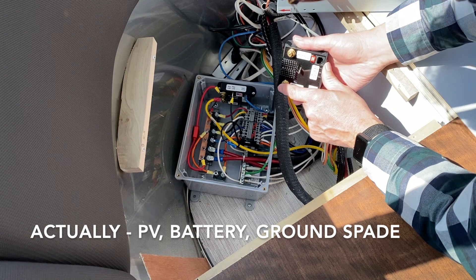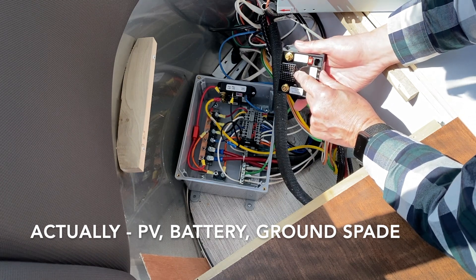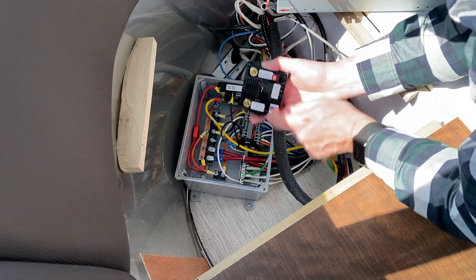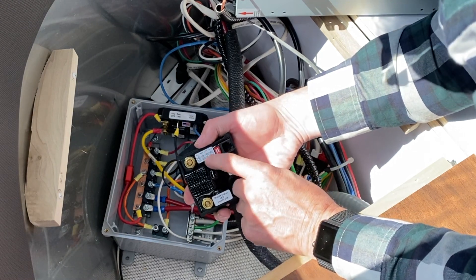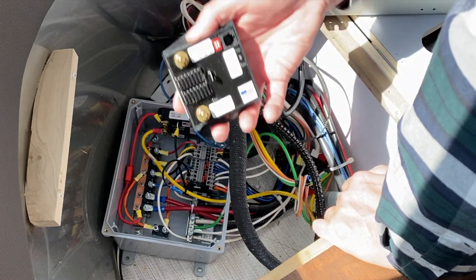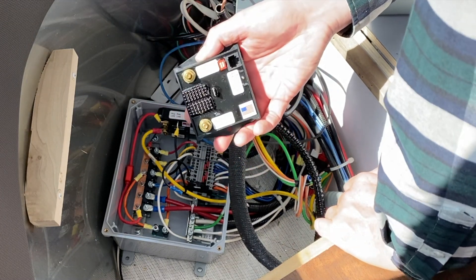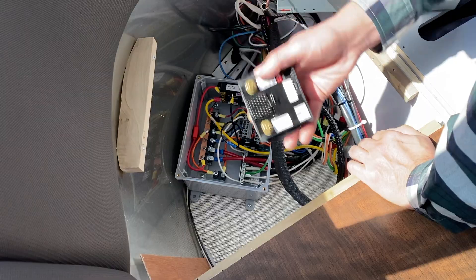You can see your power, your neutral, and some type of ground plug, and then your RJ45 connector here. So it's all going to swap one for one. I've already set the dip switches for lithium. Make sure you do that — if you order one of these, when you order them it asks you what battery you're going to use it for and they're supposed to pre-program it, but they didn't. So never assume that they did the switches right. Check it yourself.